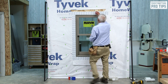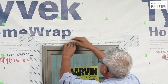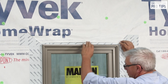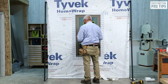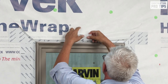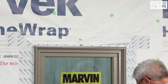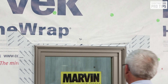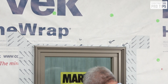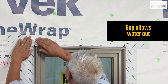The last thing we're going to do today is pull this flap down. As I pull that flap down, any excess paper that may come up here — you want to trim it so it's about a half inch above that frame. I'm going to grab a couple of pieces of tape to hold it down into place — a two-inch piece right here. I'm going to do discontinuous or skip taping. Going to this end as well, holding that down right at that corner, and over to the other corner — a piece maybe four to five inches long.